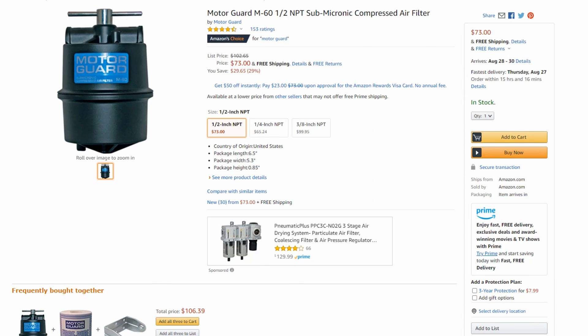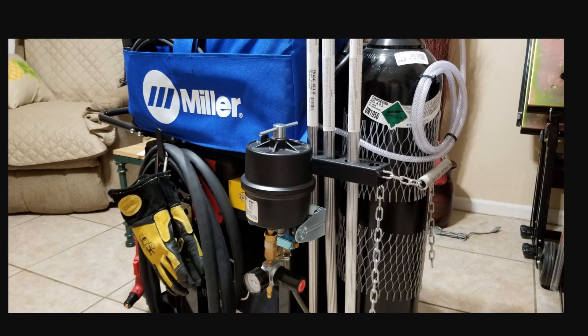These cartridge style filters are easy to mount. Here's a picture of a welding cart — this one has the quarter inch filter with fittings on the bottom, and this guy has his air pressure regulator and the filter mounted right onto the cart. One of the benefits is that the only air running through this filter is the air going to your plasma cutter. Ideally you want this filter mounted right next to your plasma cutter with an air pressure regulator, so anytime you plug into it, it's only filtering the air going through the plasma cutter at that time.